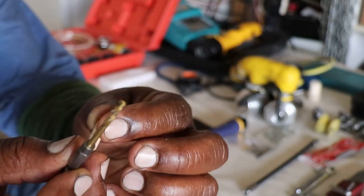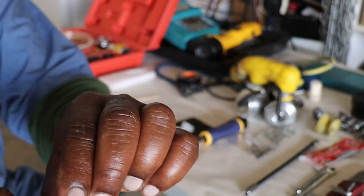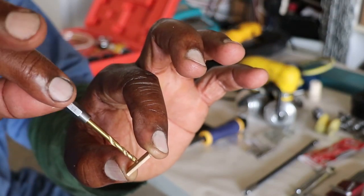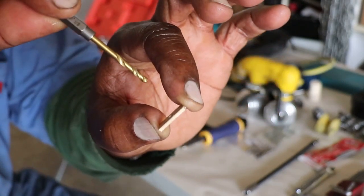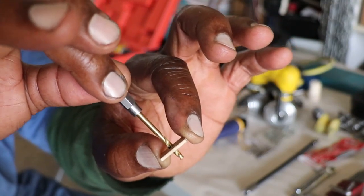Basically, it's an artificial punch location because I can't get back there to punch it or dremel it to get the drill bit started. And I'll be starting at a slight angle. So I don't want to put lateral forces on the bit. I want to be able to just push straight down the shaft and not have it slip out on me. So I'm going to have this thing glued in place, and then I'll use this hole to guide my drill so that it doesn't slip or break.